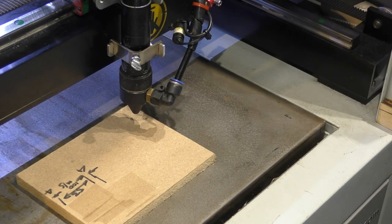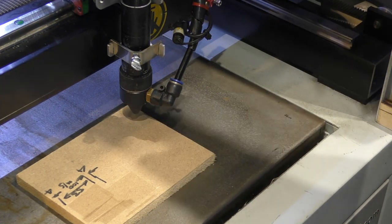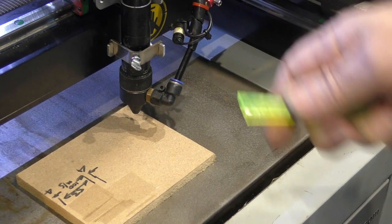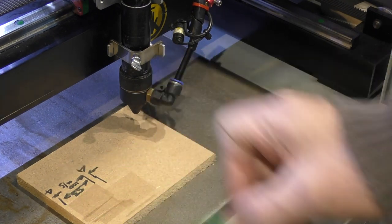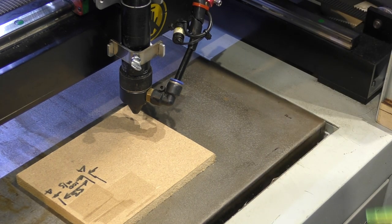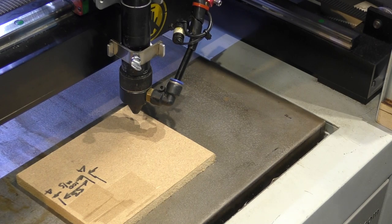Now, before we carry out this test, I've had a bit of a thought. We might not see any tremendous advantage initially, because this is quite a powerful motor system on here, as I said, with a servo system. Now, if you had unlimited power to accelerate to 500 millimetres a second, we would see a different amount of offset here. But because this is not just power controlled, I go back to the vendor settings and there is a maximum speed, there is a maximum acceleration that's allowed on the machine. So I suspect that I may well have to go into the vendor settings and the user settings and adjust the speeds to suit, to give me the advantage that I'm looking for. But let's give it a try anyway.